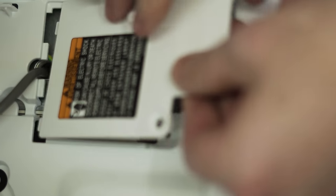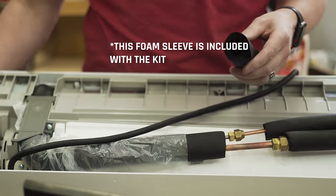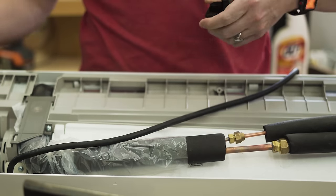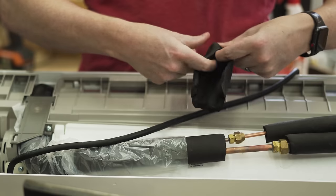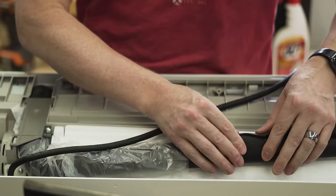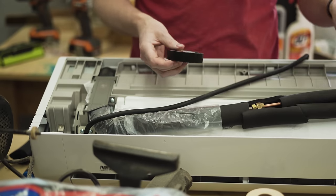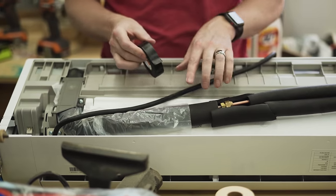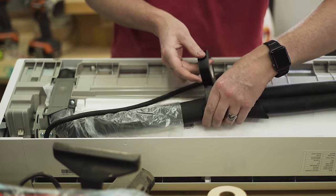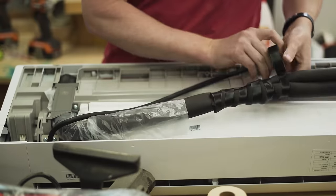With that, we're ready to put the service panel cover back on. We need to cover this part up — you can tear the insulation tape to the length you need. Wrap it around and use electrical tape to cover everything up. Wrap in the direction you're moving, so from the indoor unit outward.